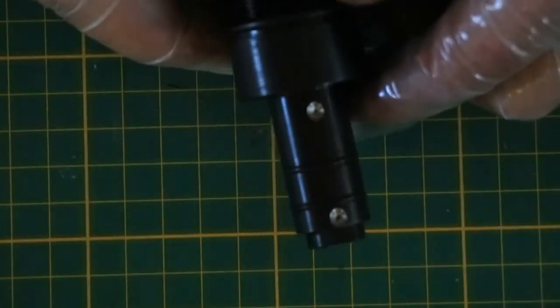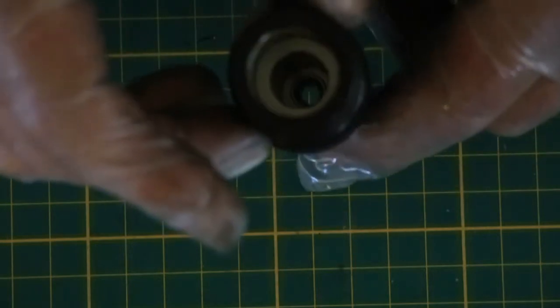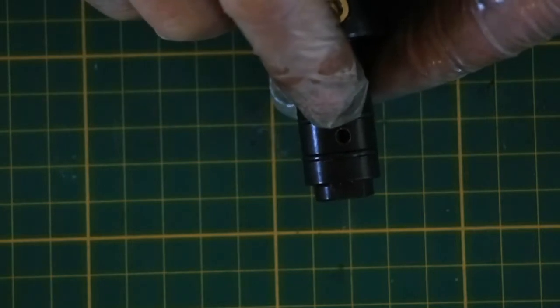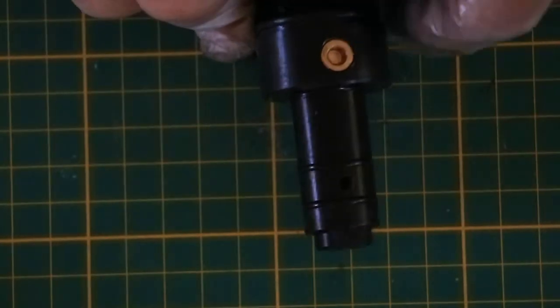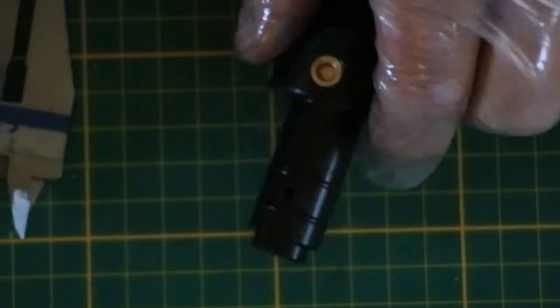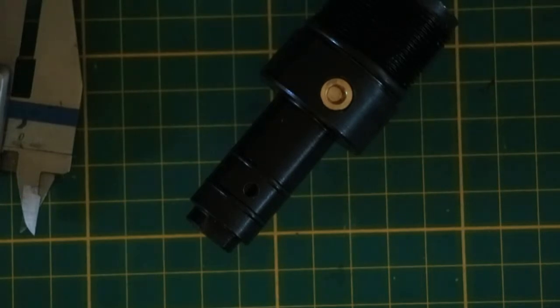So now this is the valve body. The stem has been removed. There's nothing inside there, as you see. So now we can drill out this transfer port to the 4mm, as we've just done with the barrel itself. Well, that was easily done. So this one is 4mm as well, probably, hopefully. See, it's 4mm as well. So we can assemble the valve body again. Be right back.